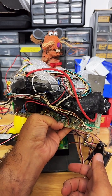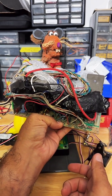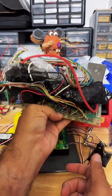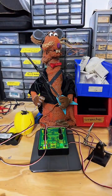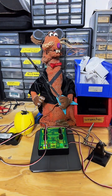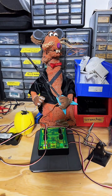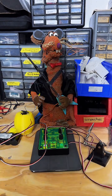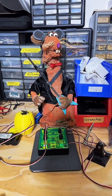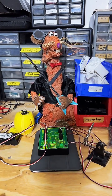If you remember that, she took apart the television, she went inside. Like, she could have got electrocuted, right? She took all those parts apart. She did not have to do that. You saw the TV monitor on the ground? All Lucy had to do was pull the TV monitor out. She did not need to take every single part of that thing apart. She could have gotten very, very hurt. Because the back of that monitor, even if it hasn't been plugged in for 5 years, has enough shock in it to knock you off your feet and possibly kill you, even if it hasn't been plugged in.